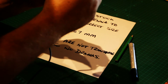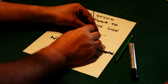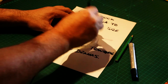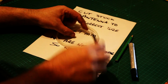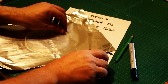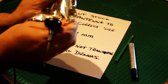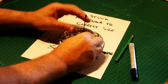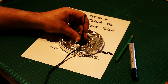Now, that alone is not enough, but that's closer to the frequency we want — 1090 megs. The next thing we've got to do is give it a ground plane; that small base isn't enough of a ground plane. Tins aren't made of tin anymore, so you can bodge it with some tin foil. We are not making a transmitting antenna, so it doesn't really matter — if we were, we'd take a lot more care. So we'll affix this to this and then do a range test against the Slim Jim.